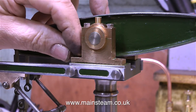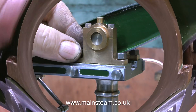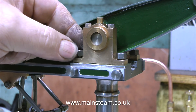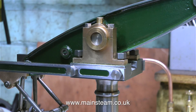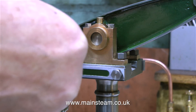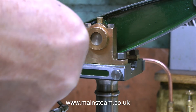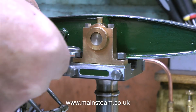This clip clearly shows how far the bearing block is lifted off the top of the column. Once I remove this burr, the bearing block sits perfectly flat on top of the column. Originally, someone had fitted a piece of flat shim steel in the centre of the bearing block, but really all that needed to be done was to remove the burr which was stopping the bearing block from sitting level in the first place.